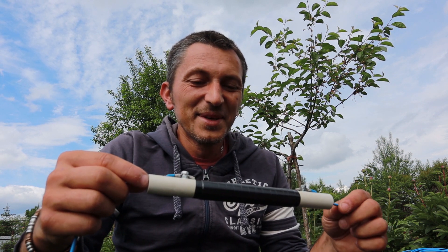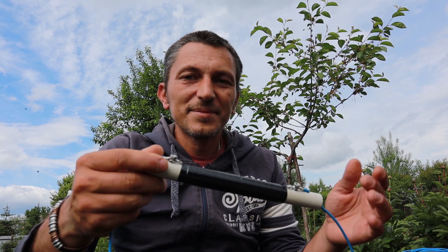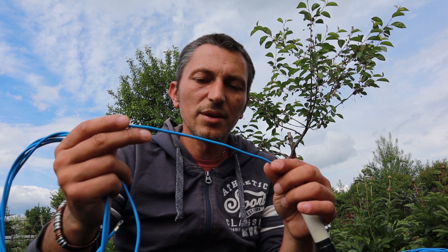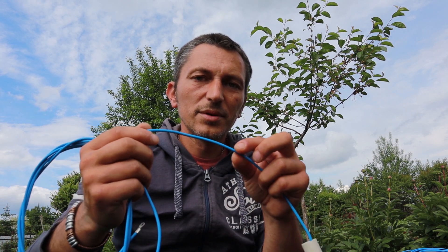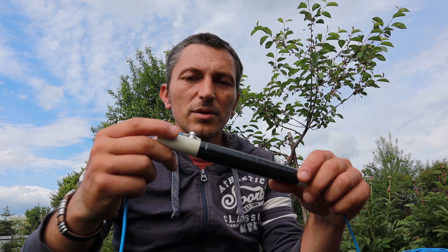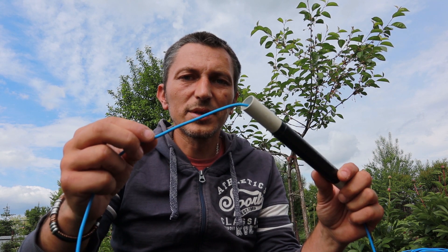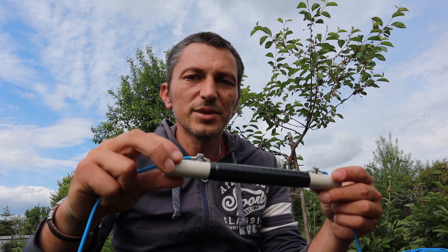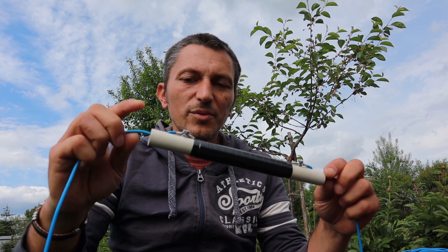I love QRP. You can even use wire different from what I used — mine has many thin wires braided together inside. Basically insulated copper wire is great to build these antennas. You could find 1mm copper wire, calculate the turns using an online calculator, and build the coil on a bigger PVC pipe, like 4 centimeters diameter, so the coil won't be as long as it would be on a 20mm form.